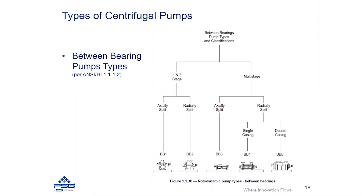You'll typically see between-the-bearing pumps on higher energy, higher flow applications, because the impeller and hydraulic design of these pumps produces such a high radial load that you need between-the-bearing support to ensure you're not overloading the shaft and causing excessive shaft deflection.